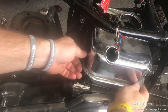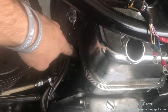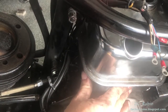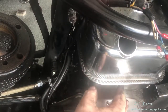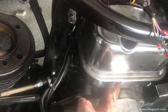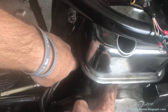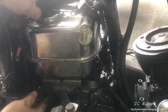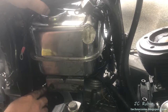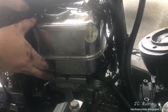This one came out with the whole rubber dampener in one piece, but because the rubber grommet was stuck on the tank I had a little extra trouble pushing it up, clearing it and getting it over. That's not a normal part of the removal procedure, I'll admit. But you can see I've cleared it. I've also cleared the starter mount — two bolts here, moved all the cables running across the front out of the way so I don't rip anything.